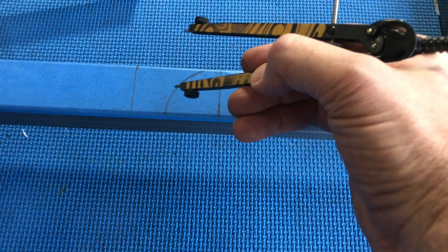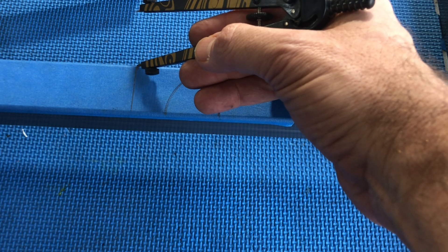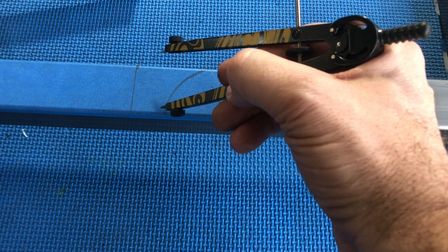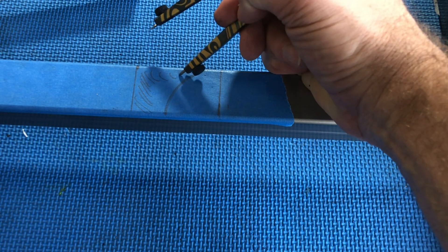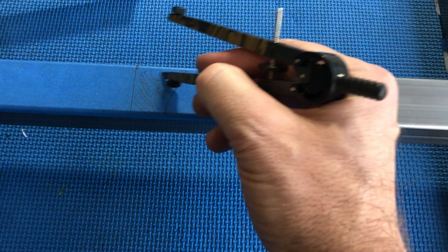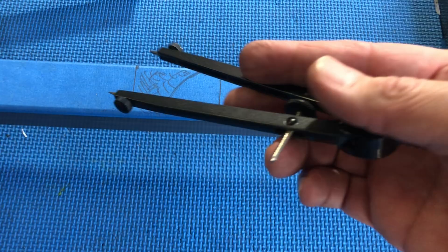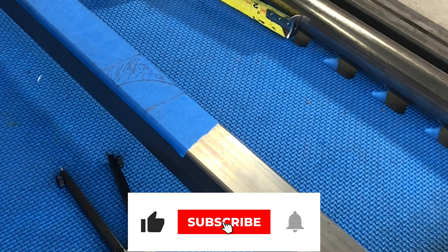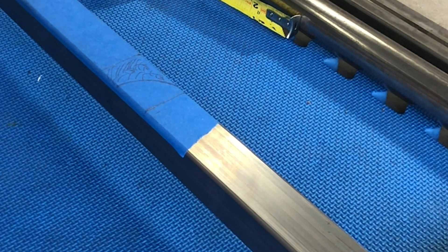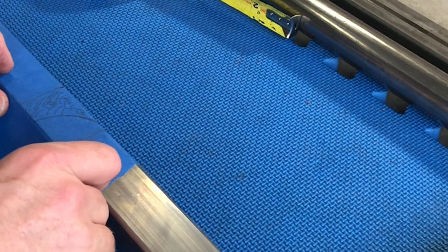If I were to take this corner and straighten this curve out into a straight line, it would end up right here. The idea is I want to take this metal, use an angle grinder, and cut out the metal I've colored in here — all of this out of the beam, straight down — and do the exact same thing on the other side. Before I cue up the banjo music, you might want to click the like button, subscribe button, and the notification bell so you can be advised when we've got new stuff going on. I'm grateful for the support, and while you're doing that, I'll finish up making all these markings and get to work.